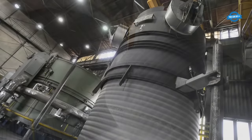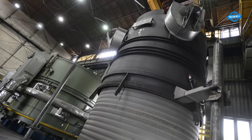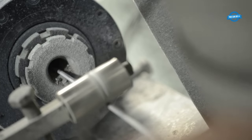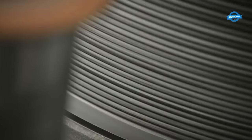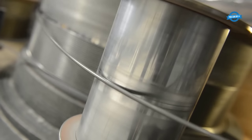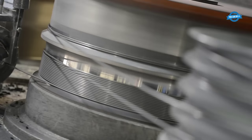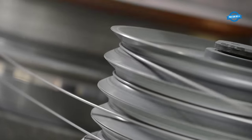To gain a comprehensive understanding of the wire's surface texture, a 3D analysis was conducted. This method offers more detailed insight compared to traditional 2D surface roughness measurements, evaluating not just elevation and longitudinal surface features but also the shape parameters of inequality and anisotropy. A Taylor-Hobson 50 profilometer was utilized, with the resulting data processed using TaliMAP Platinum software.